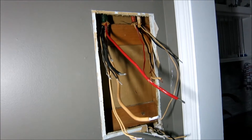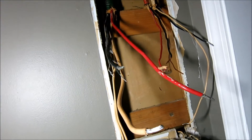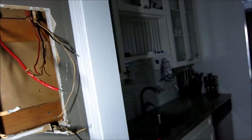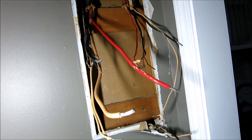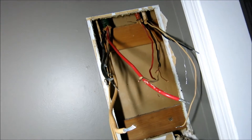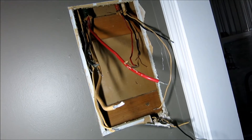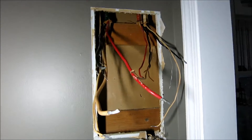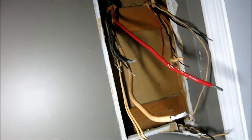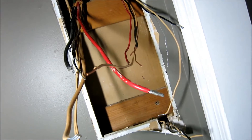What we ended up doing was just undoing everything and pulling it out, because we're going to do voltage tests and circuit tests to find out where our breakers are — mine were all mismatched. If you want everything labeled, you can tape the wires with different colors so you know which ones went to your old fuse breakers. You can tape the wire that went to the old breaker, label it 'bathroom,' and then just slide it in. I'll also be buying some penetrox since I do have aluminum wiring.